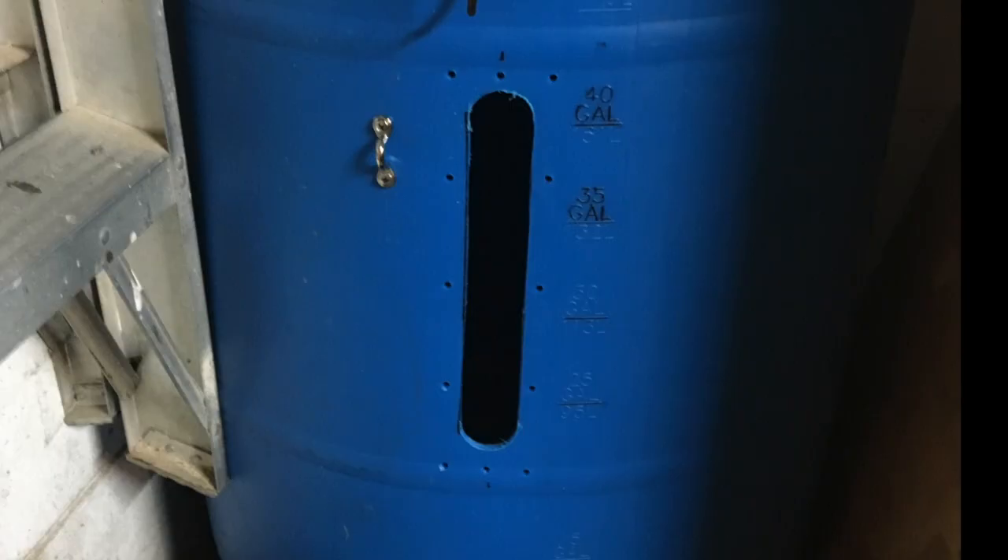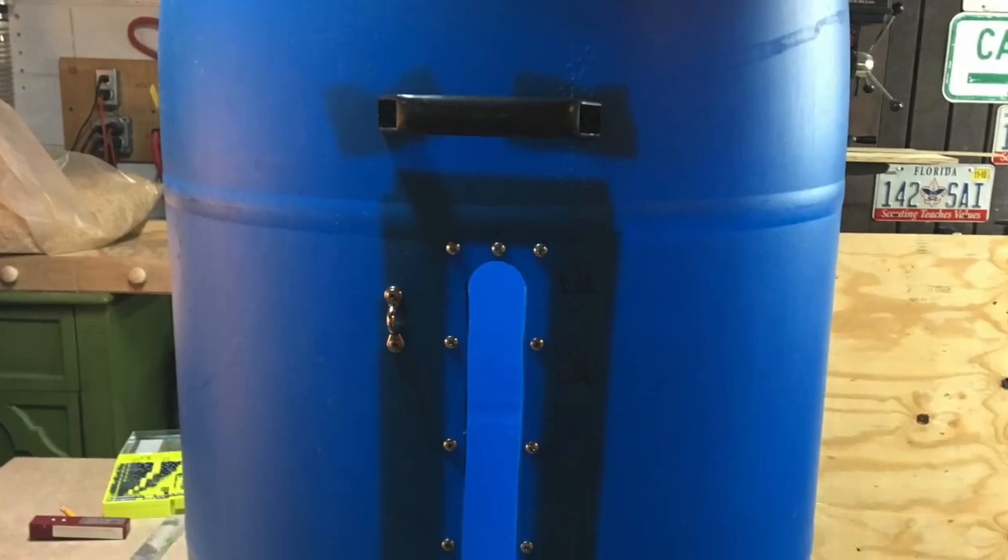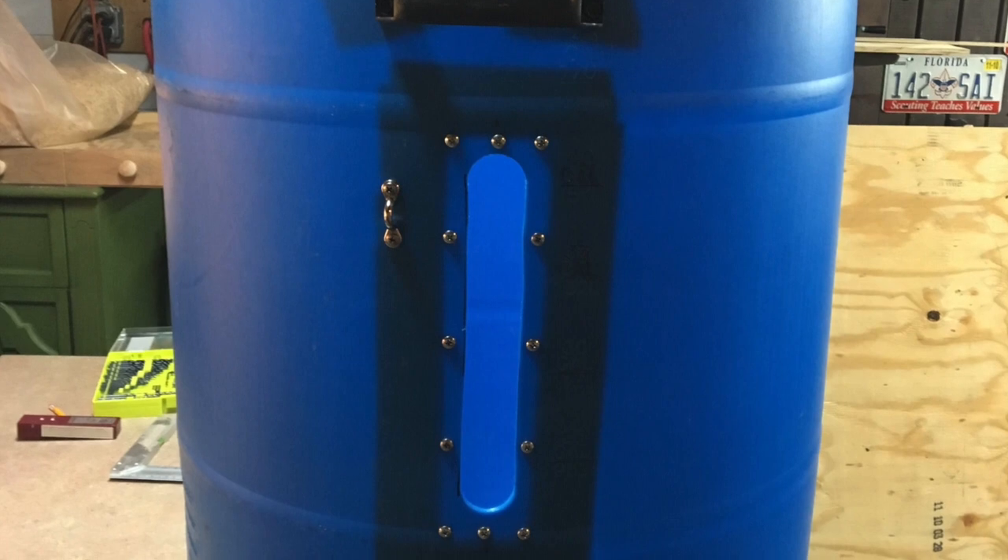If you're going to use a blue plastic barrel as your collection bin you're going to need a window in it so you can see just how full it's getting. I drilled two one and a half inch holes in the barrel twelve inches apart, drew a line between the two, and cut the rest out with a jigsaw. I then bought a piece of plexiglass three inches wide by thirteen inches long, marked the holes, drilled the holes, and connected it all together with bolts and lock nuts. On the inside I applied caulk along the edge of the plexiglass and barrel, then applied aluminum tape over that — basically a double seal. I then took the handle off the collector and mounted it to the barrel so I can move the barrel around whenever I need to.